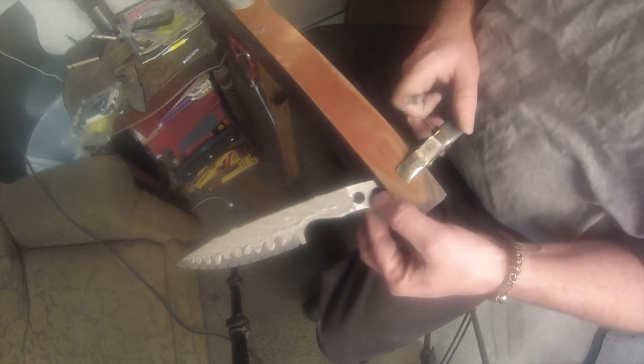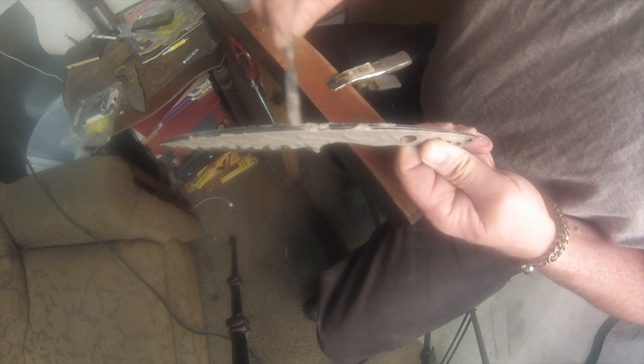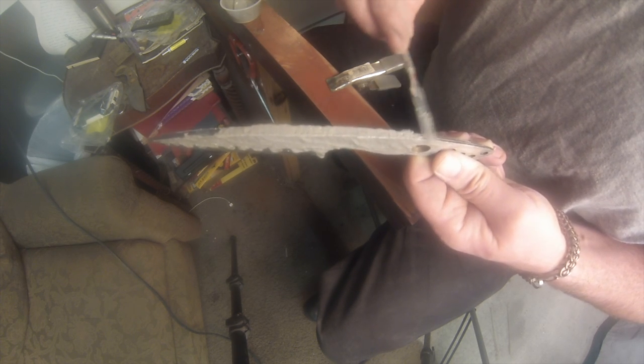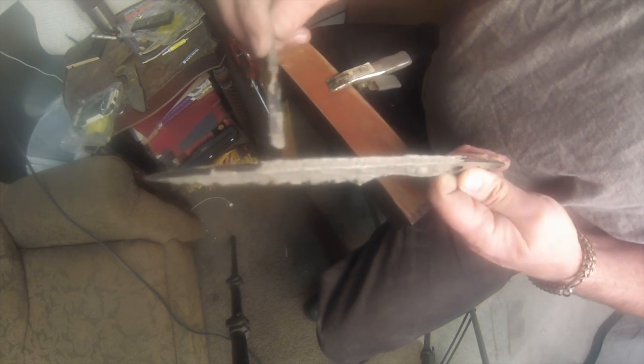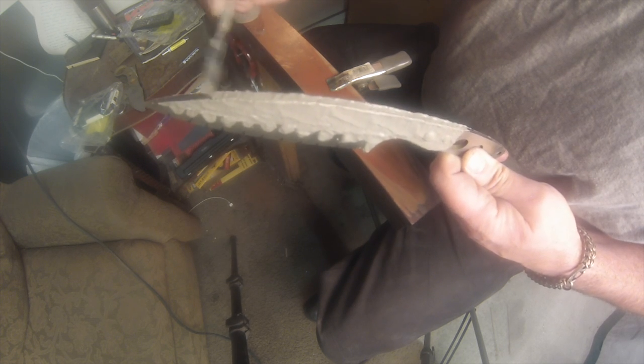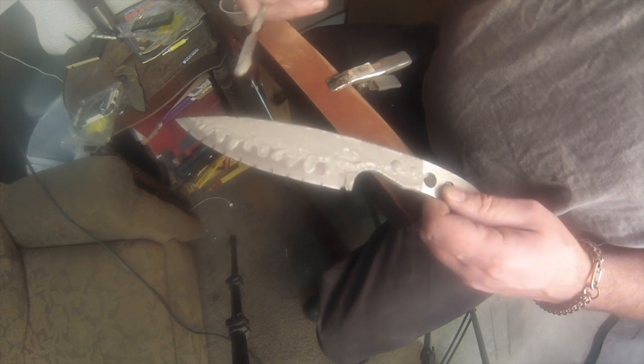There's a lot of variables going in when you heat treat. Clay thickness, steel thickness, soak time, what quenchant material you're using. There's a lot that goes into it, so you need to get everything together. And I'm not going to share everything. I've had some people share some stuff with me that I think they hold close to their chest. So in the process of all this, I don't share everything. You're going to have to learn some of it on your own. But I definitely am giving you a good place to anchor and start figuring stuff out on your own. So, at least I feel so.